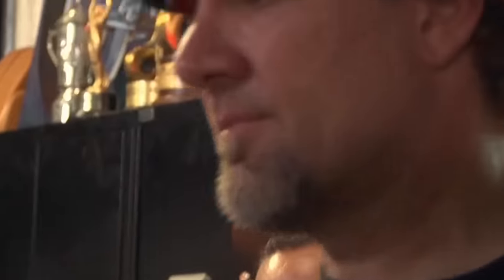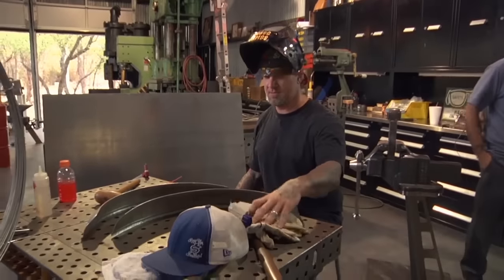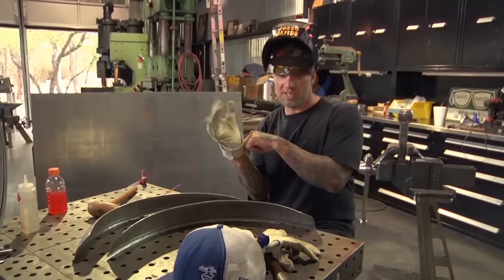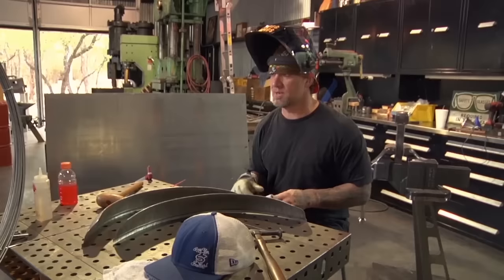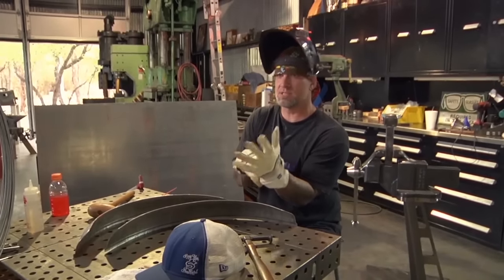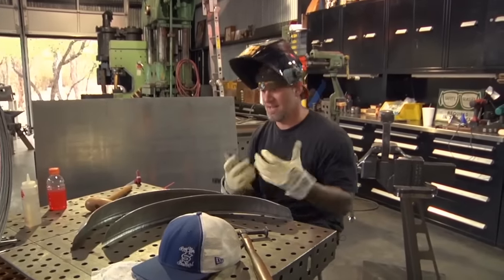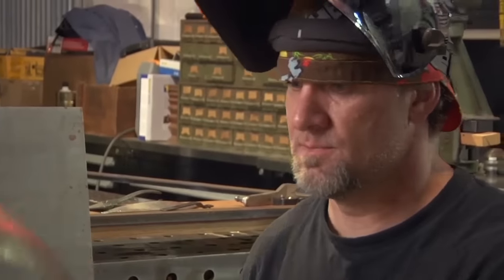Is there a reason why you're TIG welding as opposed to other kinds of welding? Well, it's pretty much the standard deal. We could gas weld it, but something like this isn't super hypercritical of leaking and we don't have to do any shaping. Gas welding's good if you have to do some shaping after the fact and it has to stay malleable. This can be as stiff and strong as we want it and it doesn't really matter.